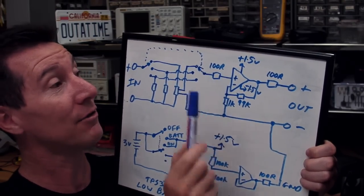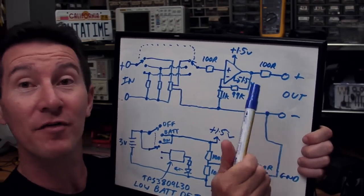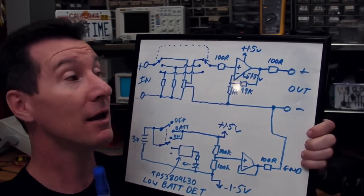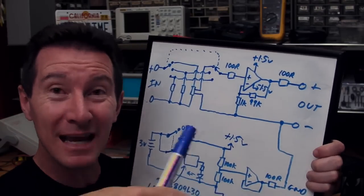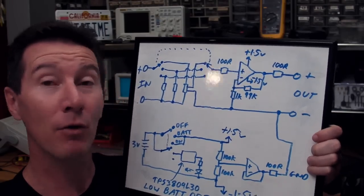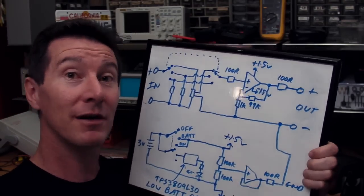You've got to be careful with this output resistor because we're driving a multimeter and it's got an input impedance. Most digital multimeters are going to be 10 megaohms. If you do the math — 100 ohms in series with 10 megaohms — the error is negligible. You have to get down to about 100k input impedance before the 100 ohms starts being a problem at about 0.1% error. So 100 ohms is a good value: it protects the op-amp without providing excess error when driving a meter.